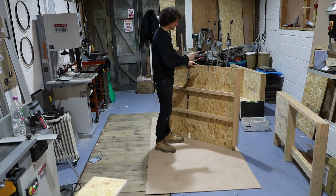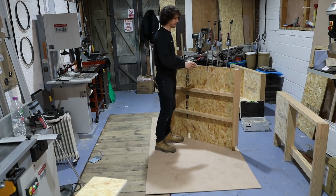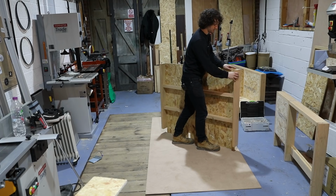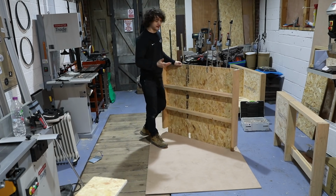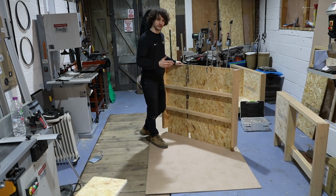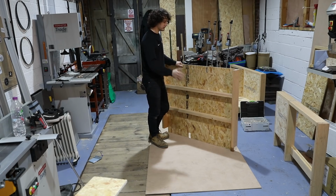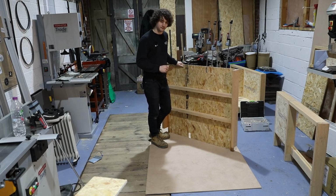What that will mean is when the glue is dried on here, it's definitely in the correct position, because where I've made those domino holes slightly wider, it means these side components can move up and down ever so slightly in order to make assembly easier. But it also means that once the glue dries, there's potential for things to be misaligned when it comes to sandwiching this between frames A and B. We don't want that. So all the clamps are going to be applied here, and then we're going to just dry fit the rest of the cabinet around it to ensure everything is in position.